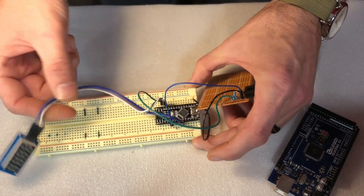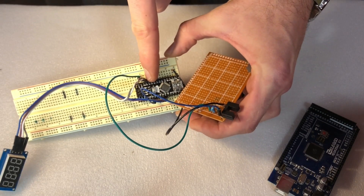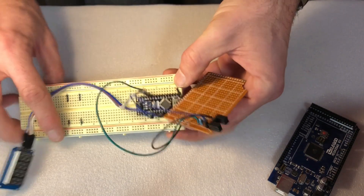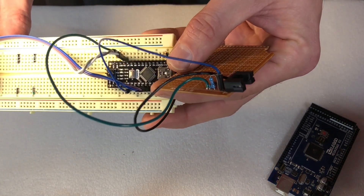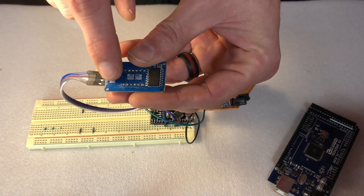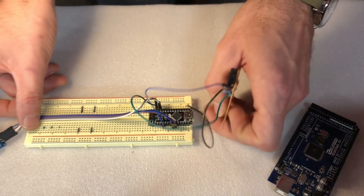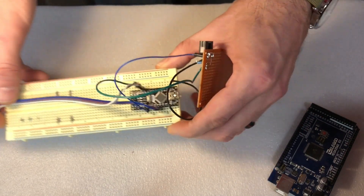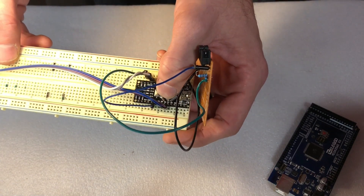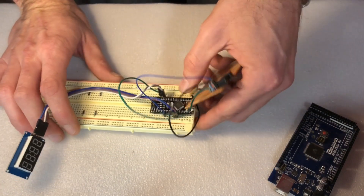The display basically jumps five volts off of the board right here — there's five volts plugged in right here and there's a ground right next to it. They both come off that and go to the VCC and the ground on the display. Now the clock and DIO, those are the two important pins — that's the digital in/out and the clock — and they're going to pin 6 and pin 7.